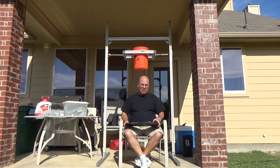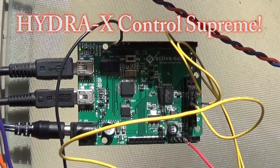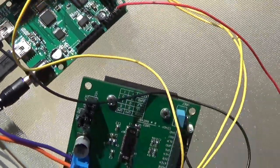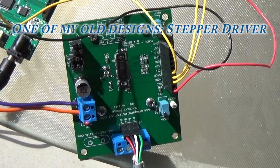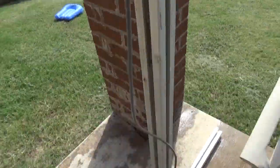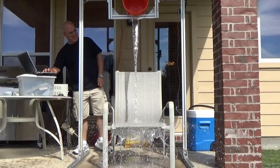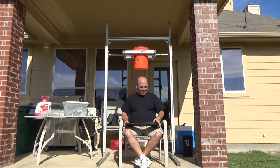The way this is going to work: as soon as I press the letter A on the wireless keyboard, the Windows GUI is going to send a serial command to the Hydra X board, which will control the stepper. It's going to drive a step signal — 350 steps — into a stepper driver, which drives the stepper, which drives the pulley, and that's most likely going to trigger the water release. Let's do it.